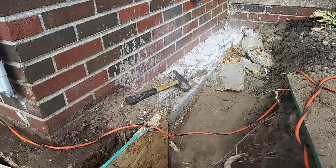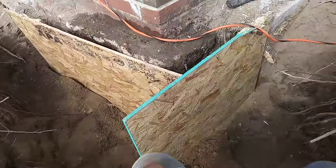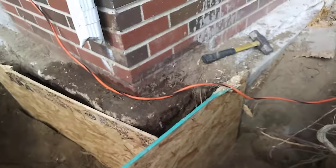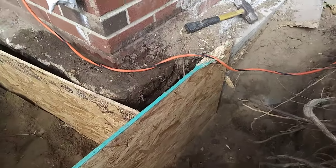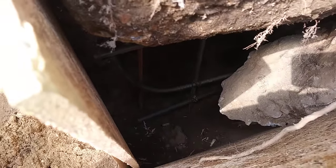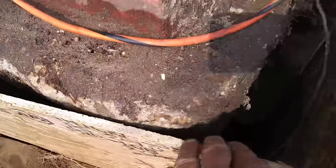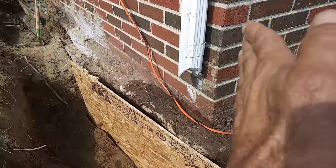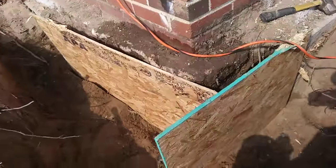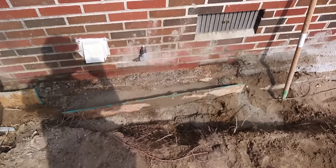The recommendation if you have an issue like this: definitely get an engineer — he'll tell you how to work the job. You do have to go by code, and your local inspector is going to have to come out and view the existing rebar. There we go — you can see some rebar with a little light. When you do the rebar, we're doing a 12x12 grid pattern — 12-inch stepped pins, 36 inches from the ground up, tied together in a checkered pattern, centered inside the footing.